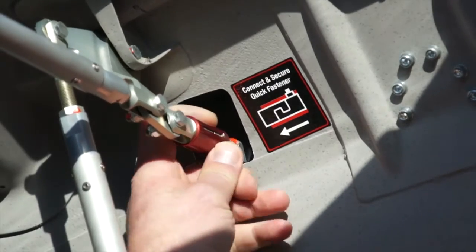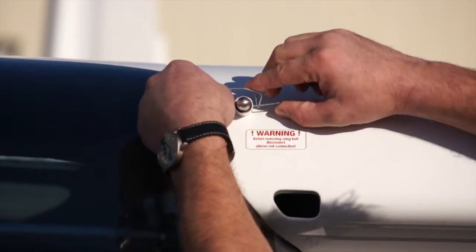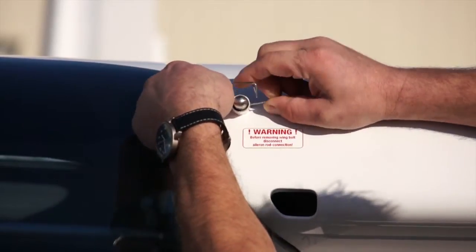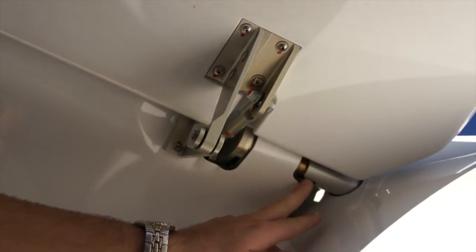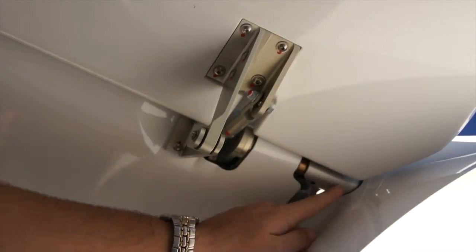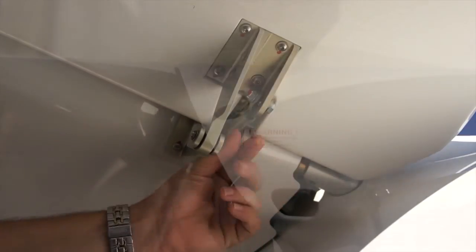Make sure to release and separate the safety coupler from the ailerons. Now, remove the safety pin from the wing pin. Make sure the flap hinge is disconnected from the flap tube to prevent overstressing the attached strut for the flap. Also, make sure you keep pressure on the flap to ensure it does not come down and strike the fuselage.